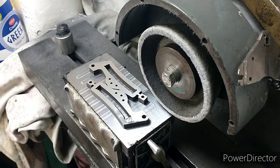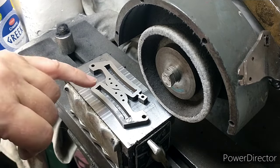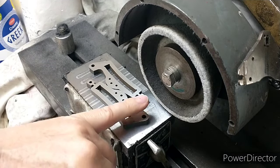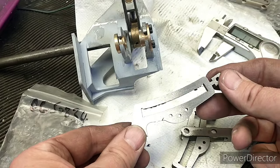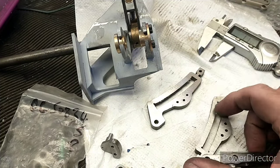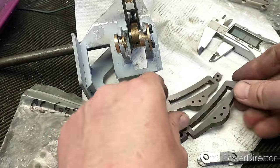I'm pretty happy with the surface finish we're getting. I've got a ten thou step-over and I'm currently doing four thou height each time - you can feel it's not super shiny at the moment. I'll probably drop it down to one thou for the final pass. Very pleased with the finish - considering it's just a tool and cutter grinder and not a surface grinder, it's not bad at all. That's the as-supplied finish and this is the ground finish I've done.